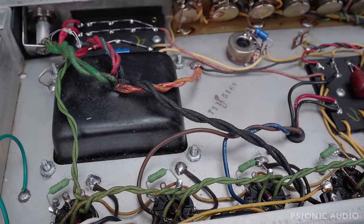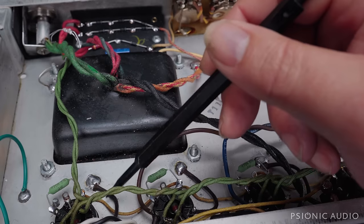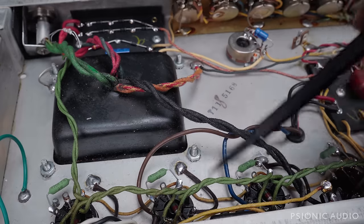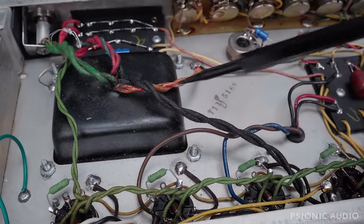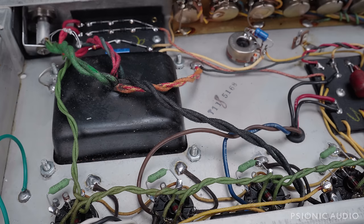I have not fully biased it yet because I know I'm going to change the output tubes, but it's biased safely at about 55% right now. In the first video I mentioned that some wires were missing here from the 68 because I forgot this amp would have had the half cathode bias circuit from the AC568. I was incorrect — the previous AB763 circuit had a straight wire from cathode to ground. These had resistors from cathode to ground with wires over to caps mounted across them — a very complicated circuit, totally unnecessary. This amp has been brought much more in line with the AB763.